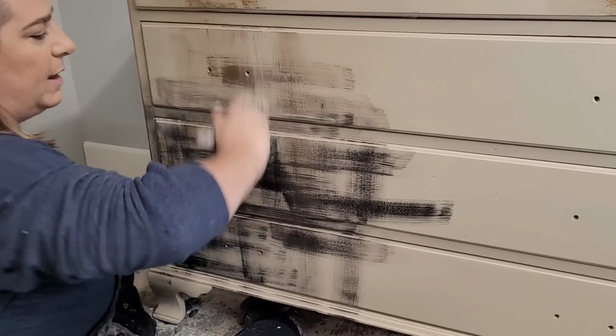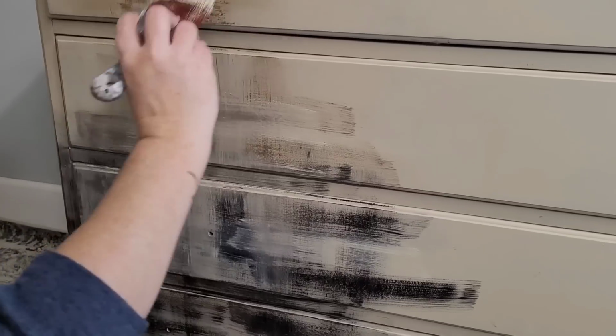We've got 2 colors. Let's go ahead and do our next one, which is going to be the burlap. And I'm going to go heavier on the burlap up top, and it's going to get lighter as we go down to the bottom. Fair warning, this finish involves about 1,000,000 brush strokes. It's fairly labor intense, but it's worth it in the end because it really comes together with the layers and the texture in the brush strokes.